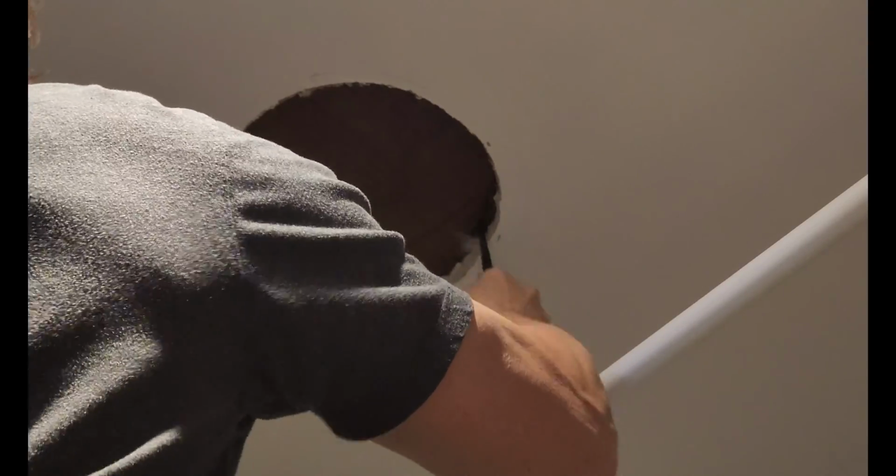I'm just trimming off a quarter of an inch all the way around. And I can see already where the drywall is busted, where I forced the last one in. You don't want to do that. You will crack the drywall and break it. Once that happens, you are patching drywall.